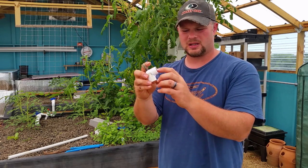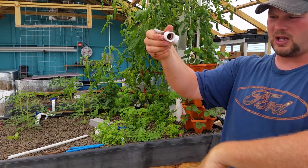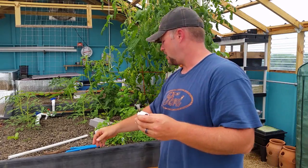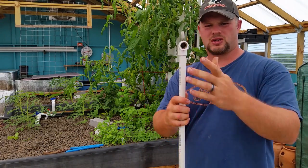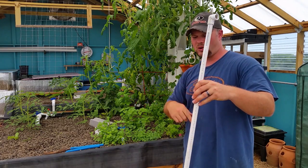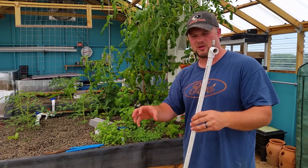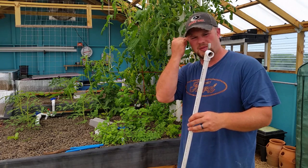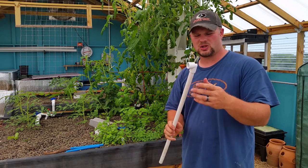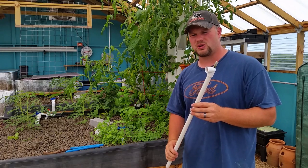You'll go right past the joint and turn that point so when the water is flowing in it's going to create a suction. It's going to suck that air down and push the air down into the water. A lot of times I use an elbow on the bottom to direct the water to circulate the bottom of the tank — that's a trick to keep debris from depositing in the corners of an IBC tote tank, since those corners will collect debris if you're not circulating the water.